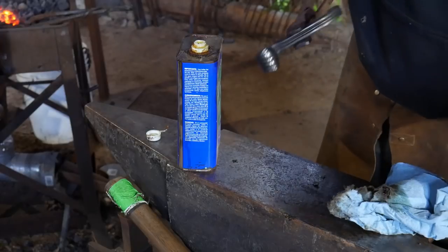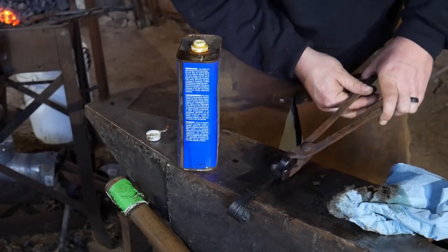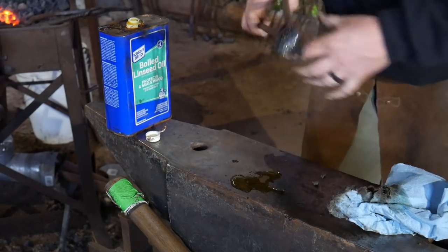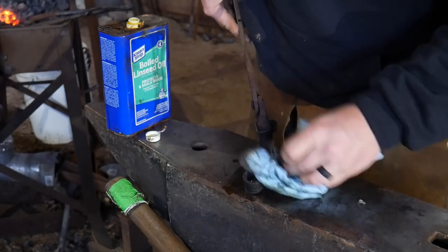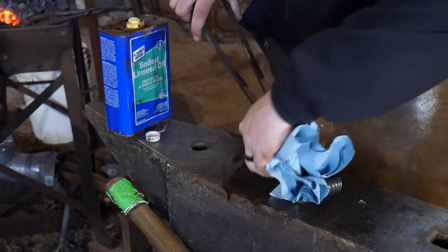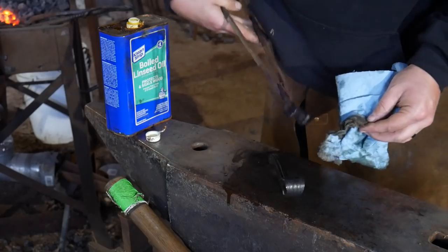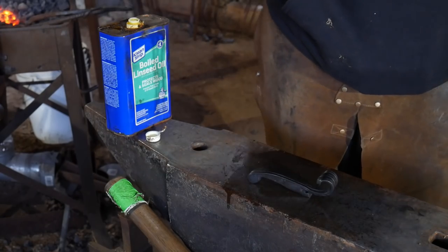Got that finish in there pretty good. There is one little area I can't get my rag into, so I'm just going to do the drain and daub method — can't get into the underside of that fishtail. I was able to get it by just dumping it in, and now we'll just towel it off. I should point out at this stage that this is very hot — the oil on this rag can get hot and it can burn you, so take whatever safety precautions you feel are necessary. Boiled linseed oil finish done. Now all that's left is to let that cool and go open up a bottle.